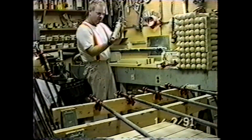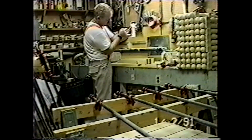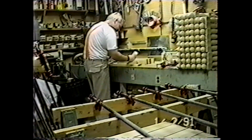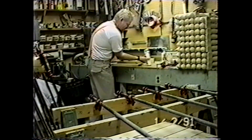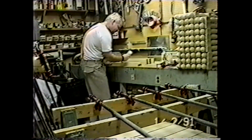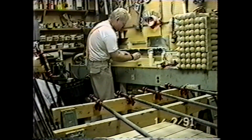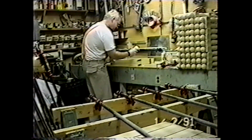Okay. You can take the old glue bottle, roll right here. Works like a charm. This is about this much water in here, 1/2 inch, 3/4 inch of water. The rest is glue. Thins it down. Does two things. Rolls easier for one. And most importantly, it's a lot thinner. Therefore, when the boards glue together, when they're on their flat or when they're on their edge, they look like one board. Not three boards glued up. And that's important not to have that. There's the fan just shut off.